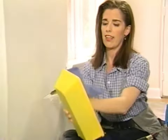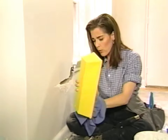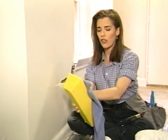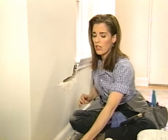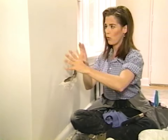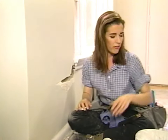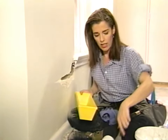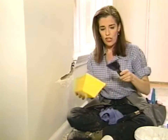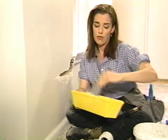Now that I've got dust in everything, I'm just going to clean out my little tray. What I think this wall is made of is plaster over wall board, which isn't really lath and plaster. In the 50s, they did a lot of sort of little piecework patches of wall board and then plastered over that. I'm going to take my three-and-a-half-inch knife and load some all-purpose joint compound into my tray. All-purpose is the best one for this application.